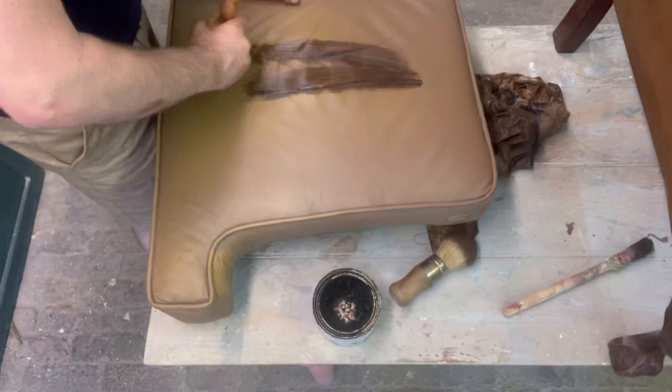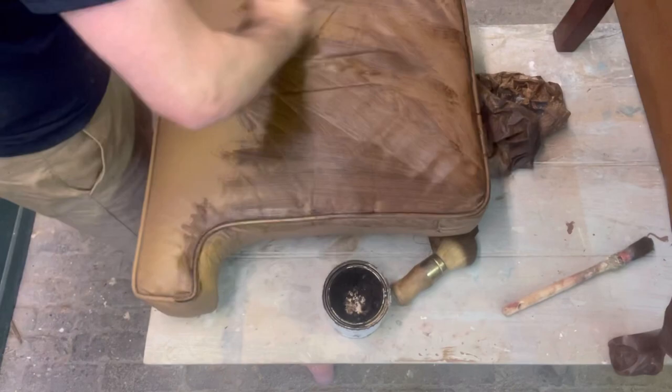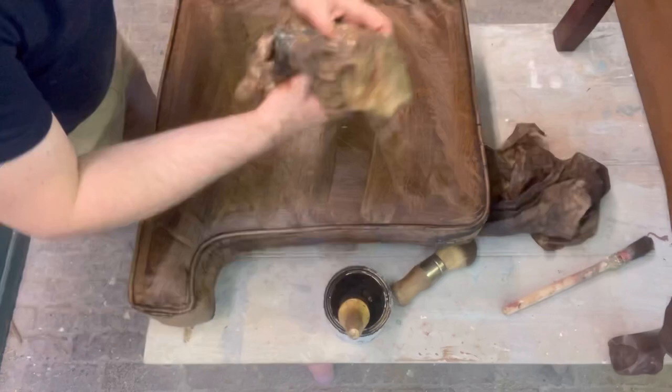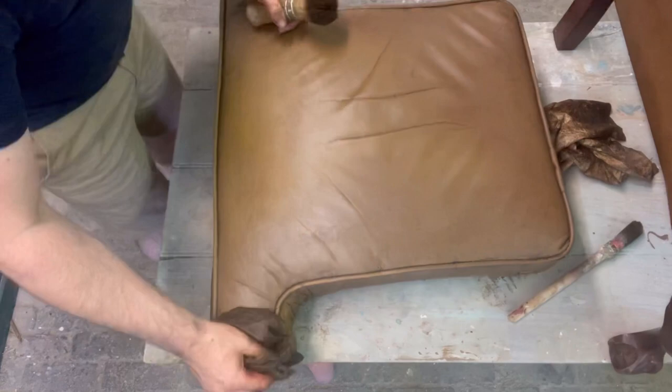So when it comes to painting leather upholstery, my biggest piece of advice would be use plenty of clear wax to soak into the chalk paint. Remember, like I said, it's like hand cream. It will penetrate the substrate and allow the durability and flexibility back into the leather upholstery. As you can see here, I'm also using lots of dark wax. This is purely for cosmetic reasons. And don't forget, once you have wiped your surplus dark wax away, use your dry wax brush for the stippling technique. It absolutely looks awesome.